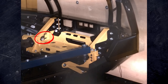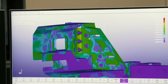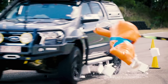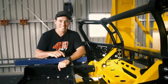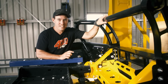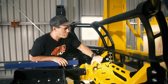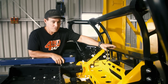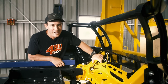The mount is designed like this to reduce force. By measuring the force going through the chassis, the engineering team are ensuring there's not enough force to set the airbags off in the vehicle in a low-speed crash, but enough for them to go off when they're meant to. Holy heck, that was quite an impact. Just having a look at the bar and the chassis here, you can see that the bar and also the winch cradle supports have taken the majority of the impact. That's bent and it slid back on those slides the way it should.